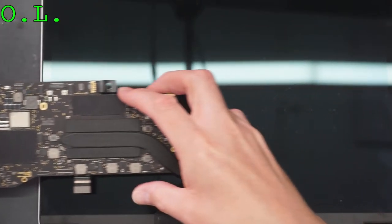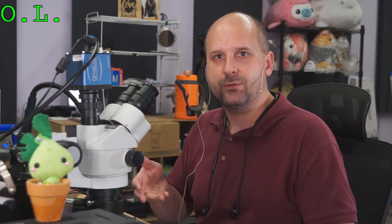So that was something else we were speculating on, that something's wrong with the screen that's feeding back into backlight, that's feeding back into this 5-volt rail that's killing the 2 ISLs. The backlight chip is on that 5-volt rail that the ISLs are on. But there's so many other things on there, I don't understand how only those ISLs are dying, unless they're just weak chips. But the GAVs are on other machines, not the GAYs. So I don't know if the GAYs can't handle the right current. The GAVs are a higher current rating.